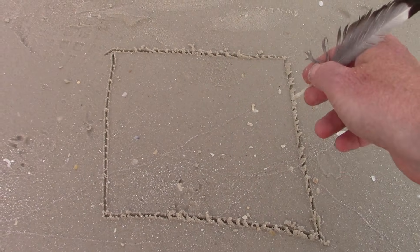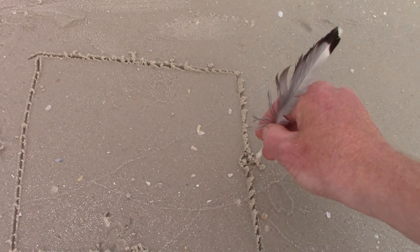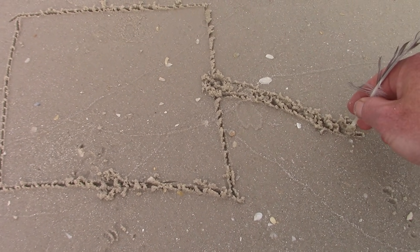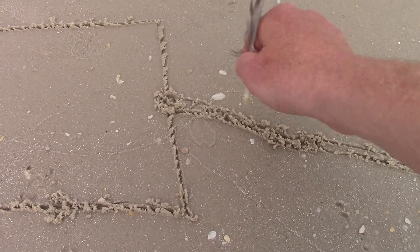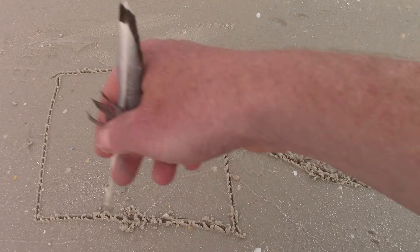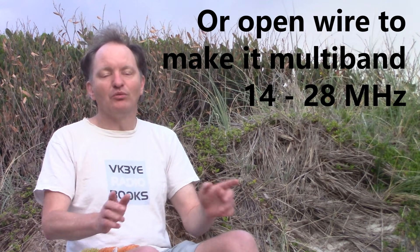Here's your quad loop — just under 4 metres a side — and you will need two supports. If you want horizontal polarization, you feed it at the top or bottom. If you want vertical polarization, you feed it at the side. Your impedance at either feed point will be somewhere around 100 to 150 ohms. One option is to use a quarter wavelength of 75 ohm coax — actually a bit less than a quarter wavelength because of velocity factor — then connect your 50 ohm coax. That provides a matching section to transform approximately 100 ohms down to 50 ohms. Being a single band antenna on 21 megahertz, you could also feed it with open wire feed line of around 300 to 400 ohms with a balanced antenna coupler at the transceiver end, and that will work on several bands.